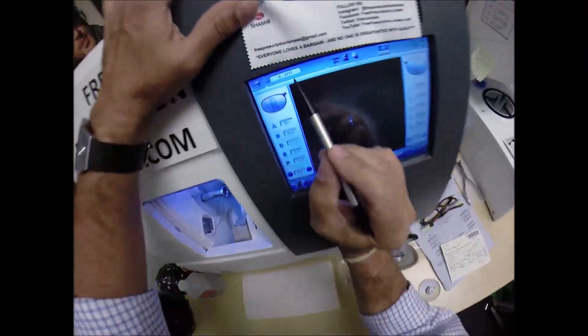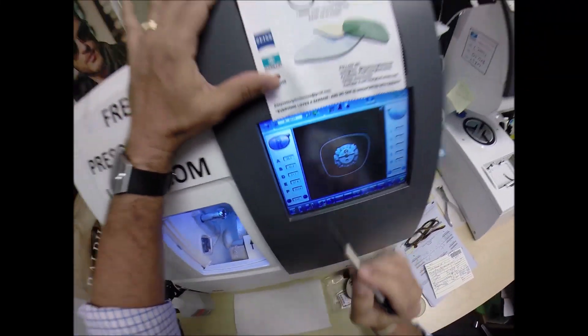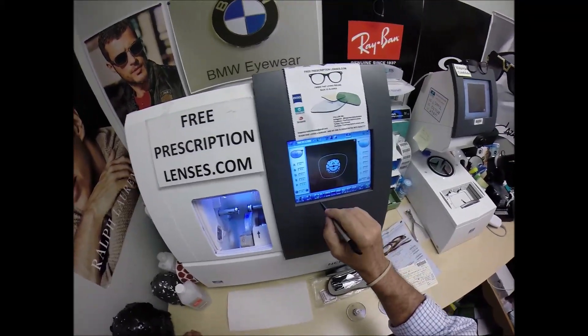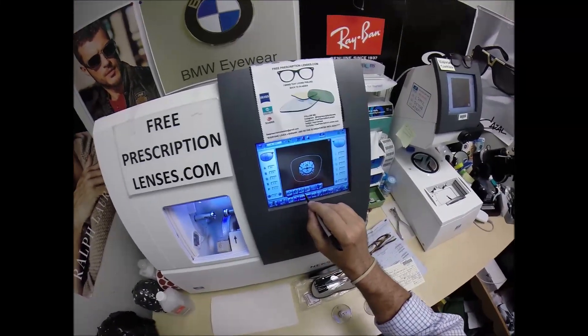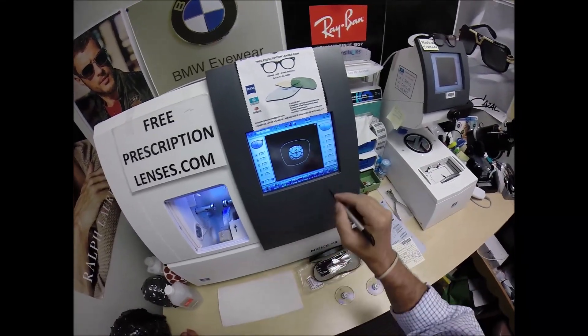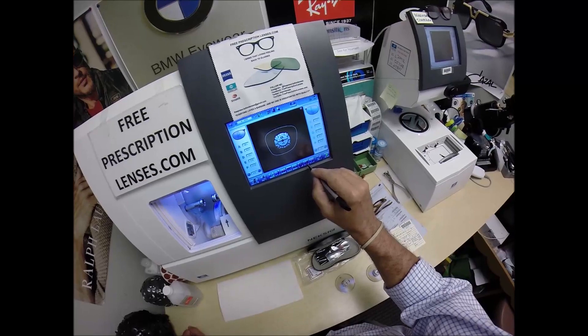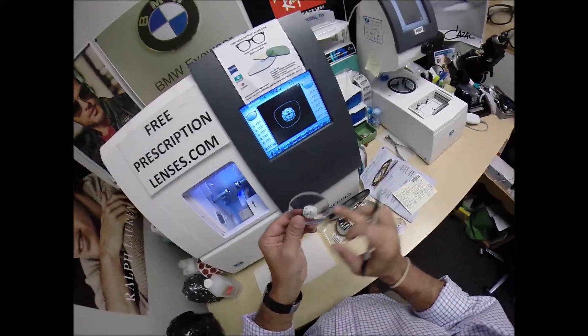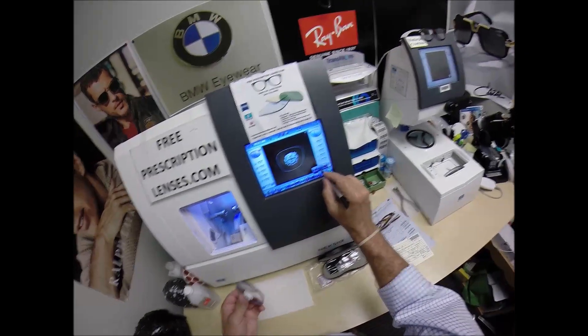Let me wake up the computer. You are job ID number 2777. Lucky you, lucky me. And these are not polycarbonate — these are high index lenses. I'm not going to polish the edge of the lens because it's not going to be seen. I'm not going to put a safety bevel on the front convex surface of the lens, but I am going to place one on the rear concave surface. I'm going to press the sticker on there firmly and place the magnet into the chuck.